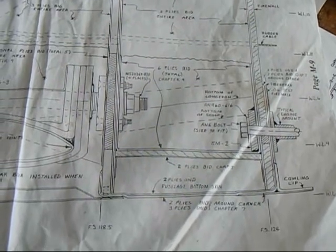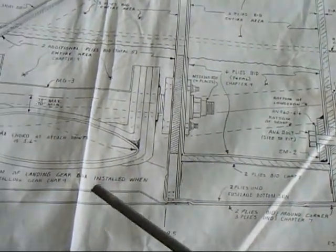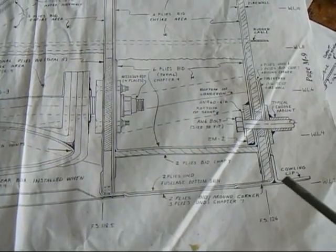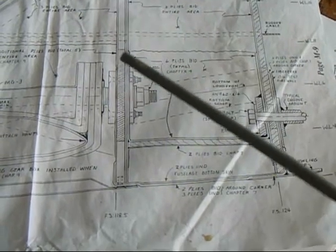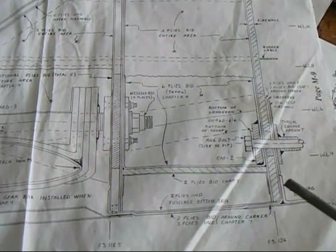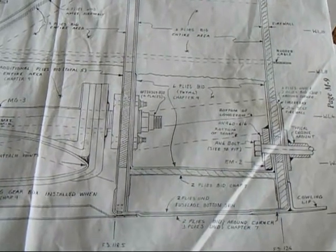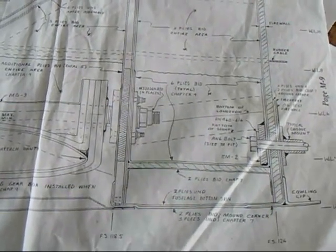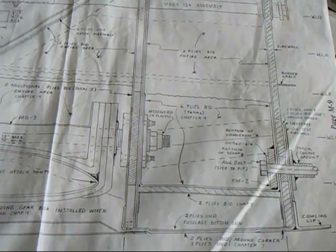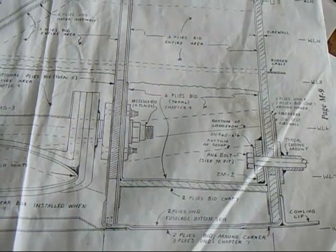This is drawing M9. I chose this drawing to show you the structure of that back landing gear area. This is the landing gear box we're talking about up here, but I'm going to support the aircraft on this section right here — this is certainly structural, and this is structural here as well. Looking at the number of layers of fiberglass, this is a very rigid area. I'm not sure I'd support a fully constructed aircraft with an engine on it, but my engine is not on. I'd estimate the aircraft weight at this point at around 700 pounds, with a center of gravity at about 106 inches with the canopy and canard off.